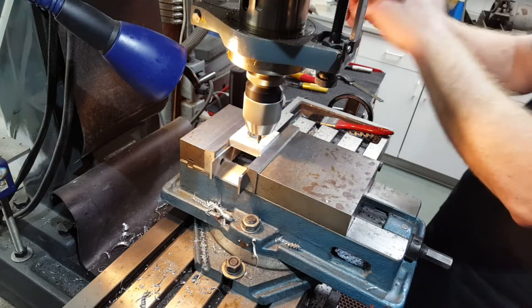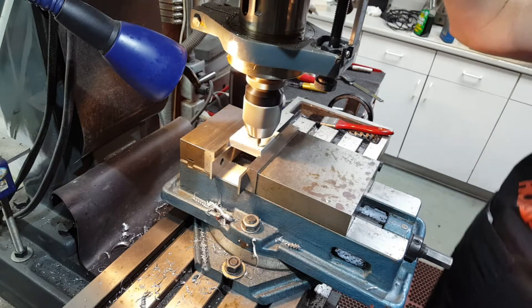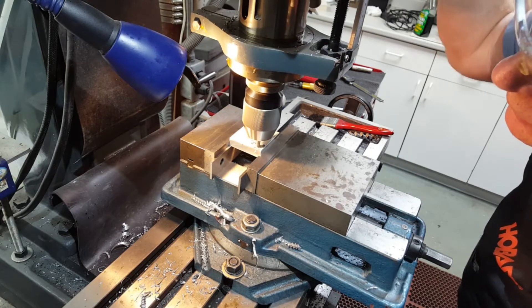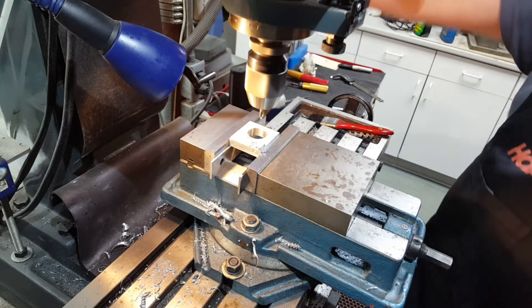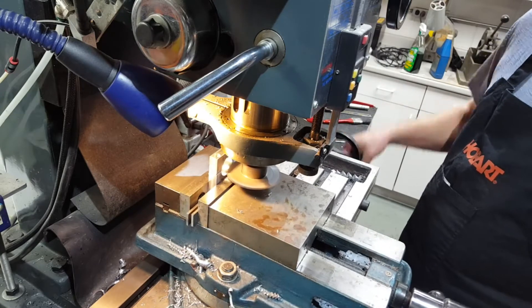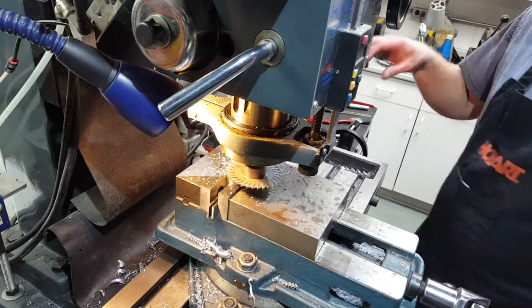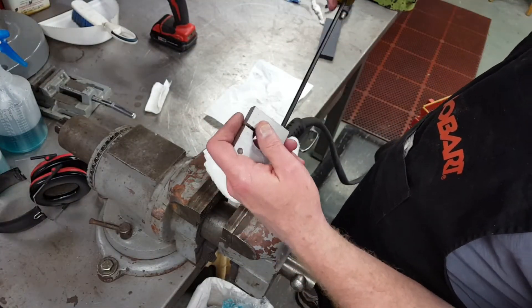Next step is to drill the two lower holes on the split clamp. These are the holes that are going to hold it to my backing plate. The backing plate is actually going to be a piece of Nylatron plastic that's going to electrically insulate the torch clamp from the body of the ChopBot itself. The final step after the rear mounting holes is to turn the clamp back on edge into the vise and then use a slitting saw to cut it right down the middle, making it like a bearing cap in an engine where each side is exactly a half circle. When I put it together it won't bind and it won't mar the end of my torch.